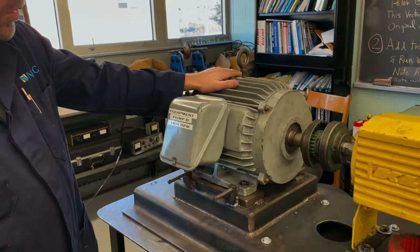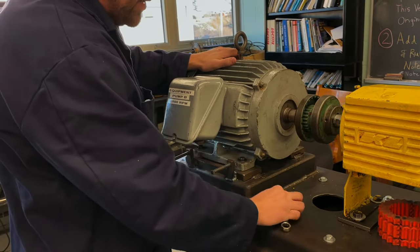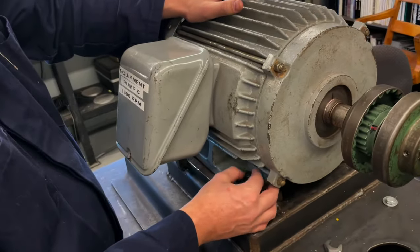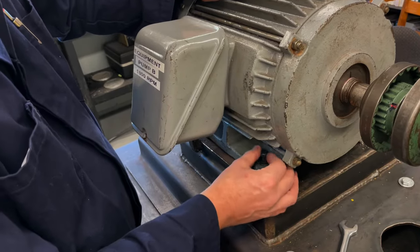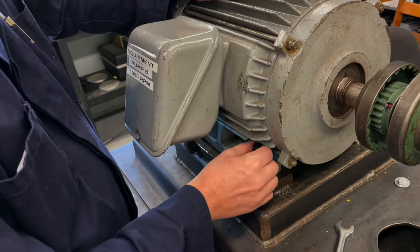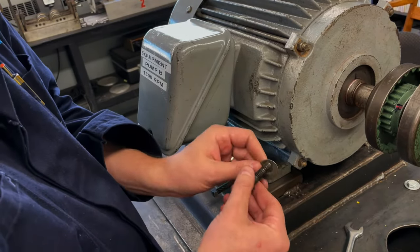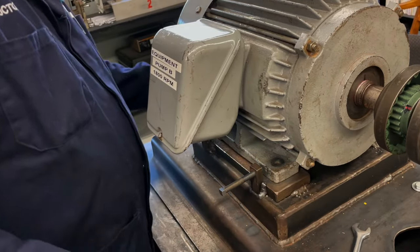For the motor itself, pull the bolts out and make sure they're in good condition — always a good idea to lift them right out of the threaded hole and inspect. I grabbed some new bolts and new washers from the tool crib yesterday to make sure our hold-down is good. If you have the opportunity to move the motor out, look at the threads and make sure they're in good condition, chasing them if needed.